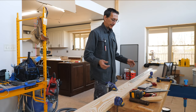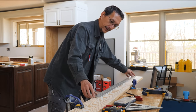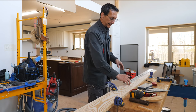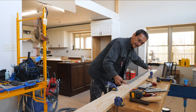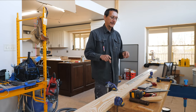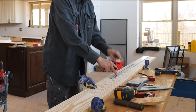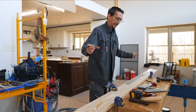This board's 87 inches long, so I'm going to take the center of that. I've got my four-foot straight edge here and we're going to line this up in the center of this board — that's going to be the center mark. Code says you cannot fit a four-inch sphere between the balusters, so they've got to be close enough together so a baby can't stick his head through and get stuck. I'm going four and three-eighths on center. That way, once the baluster's in there, they take up some space and it's like a three and three-quarter inch space, so I'm well within code. I'm going to step off four and three-eighths until I get to the end on each side, so the end ones are spaced the same.